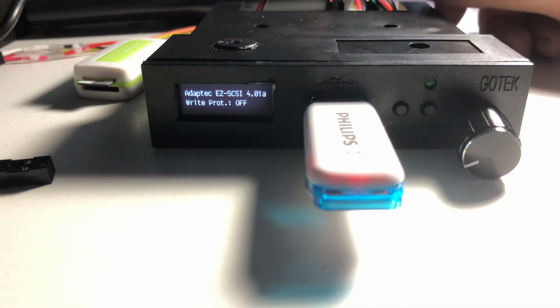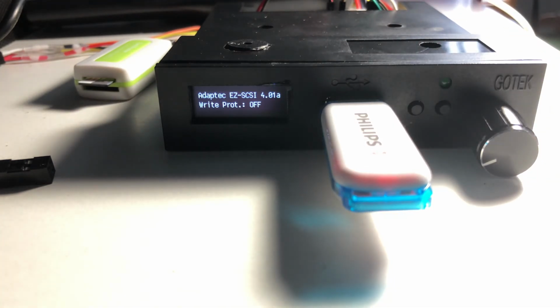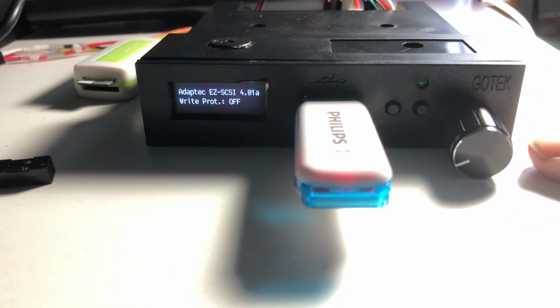Now, as for the wiring of this, just look at the wiki. The diagram on the wiki shows the rotary encoder looking up, so looking this way to you instead of on the other side, so take that into account. And I'll always try to check if this is ground. You get it on the PCB mounted, it has a pin that says ground. You can use a multimeter to test. Do it. Always be sure.